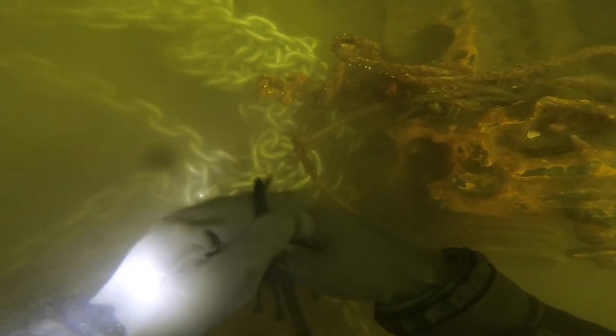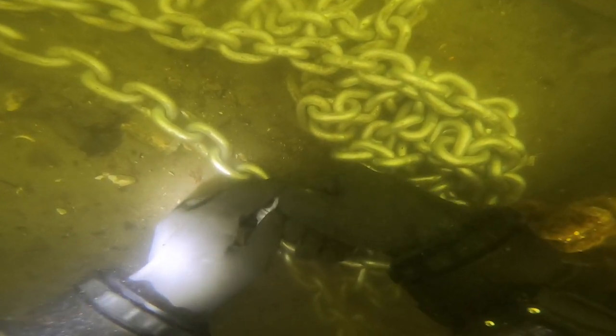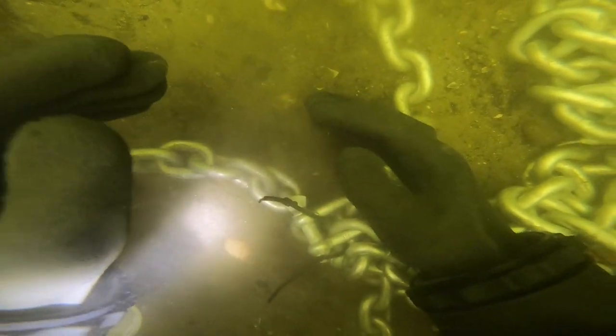The last thing I have to do is take a zap strap and thread it through the little hole on the shackle pin and then through the shackle itself. This is just to make sure that if the chains are getting rattled through wave action, the shackle pin doesn't work itself loose — that would be bad. So that's zap-strapped in place. Also, the shackle pins have been coated with never-seize, which makes it much easier because it prevents them from corroding and bonding to each other. Threading that zap strap through the little holes was really hard work and took a long time.